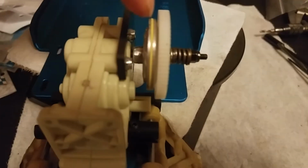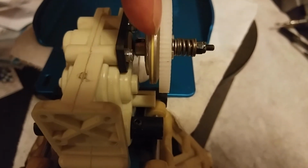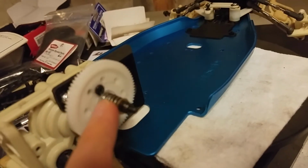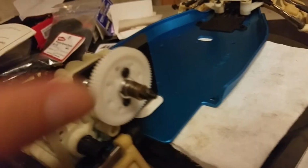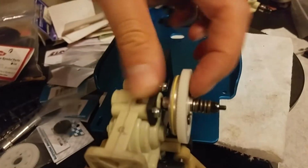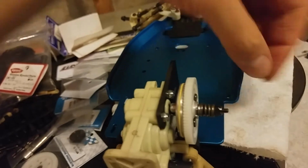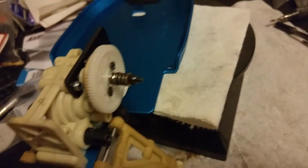So in here, between these 2 plates, is a 5x8 bearing. And then in here is a 4x8 bearing that goes into this housing here. And then I took that thrust bearing and just slotted it right on. So basically that inner 4x8 bearing there sets the thrust bearing to the correct offsets, and then you can mount this onto this part of the shaft, and there's no extra play or anything. And then with the spring, it's all set.